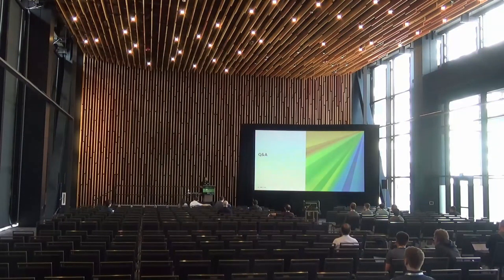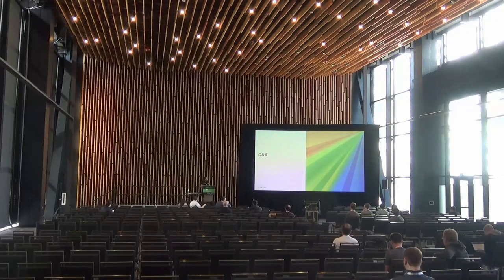Right, so, within the memory, if you look at the partitions, you can see which ones are not using as much. You can get away with shutting off power to those memory partitions, and that's the way you could do it. Okay, so you look at the map file and then decide which ones to switch off.